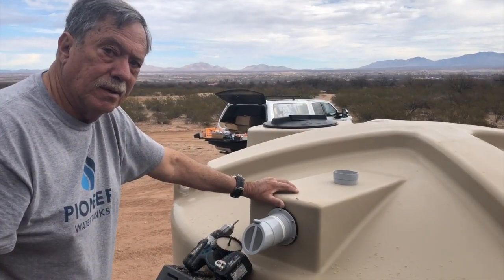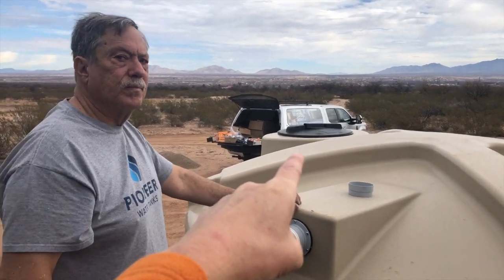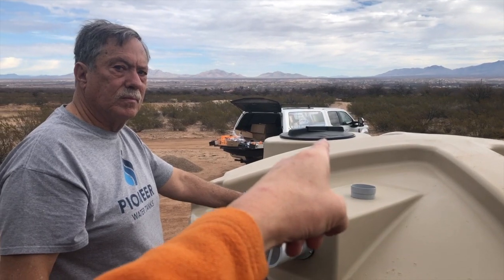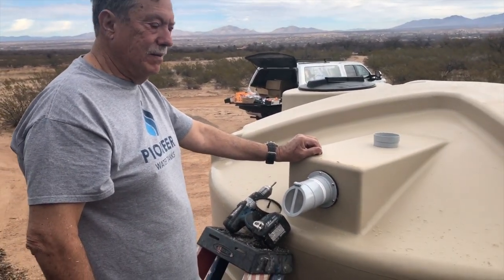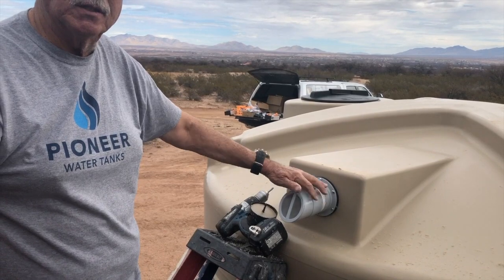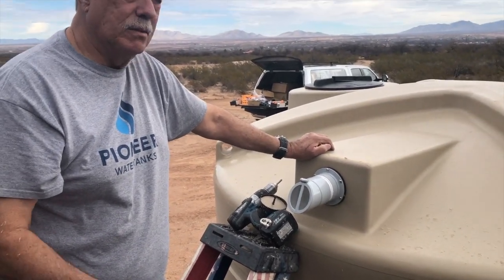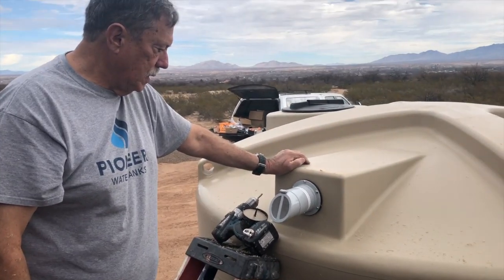There are so many different examples on the internet of how to use these things. I actually didn't know before you came. I didn't know that the standard or main inlet was in the top of the lid. I actually thought you were supposed to go in on these bulkheads. Also, something else, I would recommend painting these because the plastic is not UV tolerant. Good point, especially here in Arizona. Get some spray paint, tan colored spray paint, and paint them.